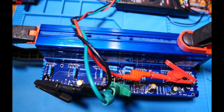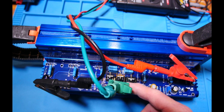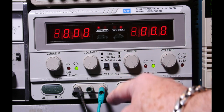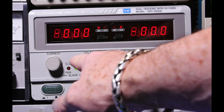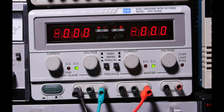I've got the power clip on the board — there's our plus 34 and minus 34, and our ground right here in the middle. Outputs are right here and inputs right here — they're not going to be connected yet, we're just going to power this up and see how it goes. I'm going to use this power supply, with the two sides in series, so we get plus, ground, and minus — like two batteries in series.